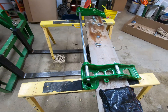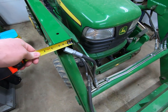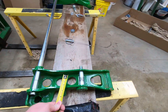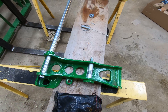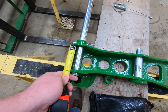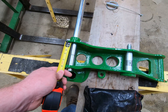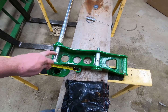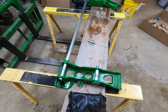We have two other problems. The loader frame on the x748 and the 45 loader is two and a half inches, but these brackets are three inches inside to inside — so we have a half inch to deal with on that pin. On the other bracket, it's approximately three and three quarter inches, so we have over an inch — about an inch and a quarter — to deal with on the lower part of that bracket, because you don't want the brackets sliding back and forth.